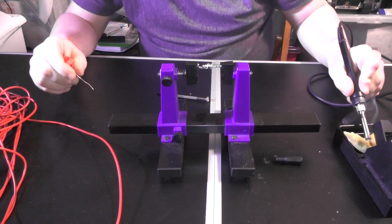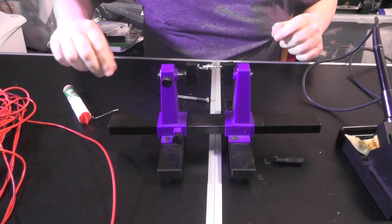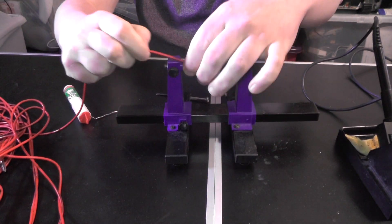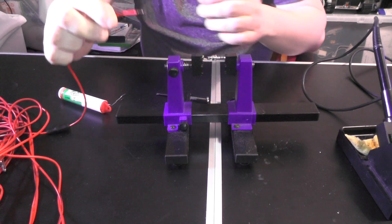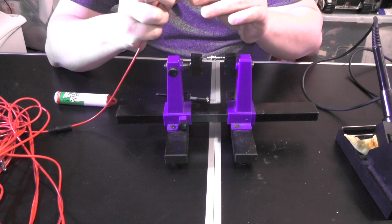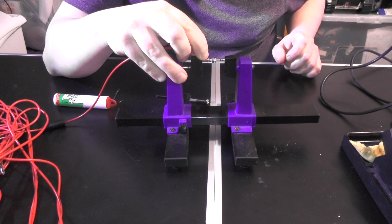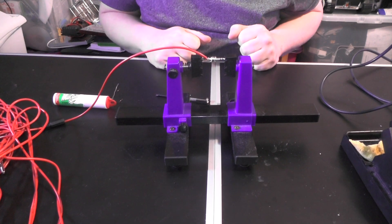I'm just going to add some solder to the tip, then we can add the cable and close the connection up. My connection is a bit loose in the helping hand so let's tighten it up. Okay, not the best — hopefully it'll do. Now what I need to do is place the black plastic part onto the cable — you want to do that first, otherwise you'd have to go all the way around the rest of the cable just to put the connection on. Now we need to solder that wire to the part we've just done. I'm going to bend the wire in half to make it a bit smaller, then solder the wire on. Right, so that's on — not the best of jobs, but it's what I can do on camera. I'll let it cool down a bit and add the surround, and we should be good to go with our portable shortwave antenna.